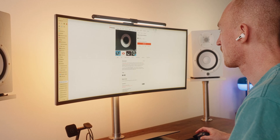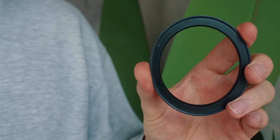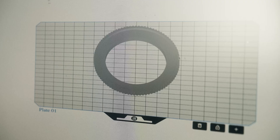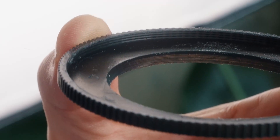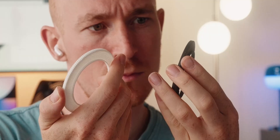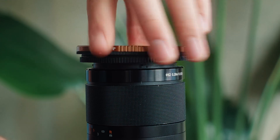I wanted to make a step-up ring for a camera filter, but camera filters have really fine threads — so fine you can't really make them with an FDM printer. I threw this into the resin printer and the result was amazing. It looks really close to an injection molded part, with perfect detail on the sides and the threads, and I also love the perfect finish of the top surface. No more layer lines, just one clean product. Functionally it might not always make a difference, but feeling it and touching it just feels good — it makes me happy.